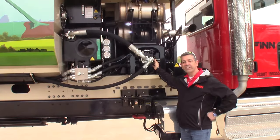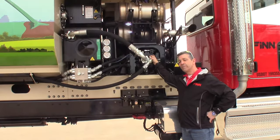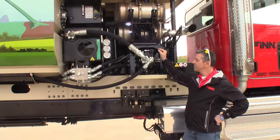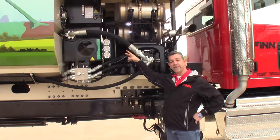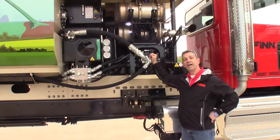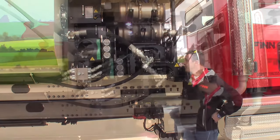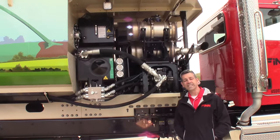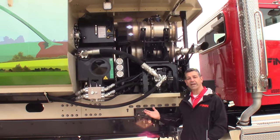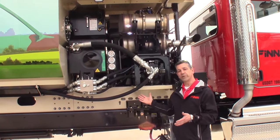You've got a John Deere 173 horsepower engine driving these hydraulic pumps mounted to the engine, which are powering your hydraulic components: agitators, two beefy agitators, hydraulic hose reel, and a hydraulically driven pump. We have eliminated our clutch on this model. Going for a final design necessitated a larger hydraulic tank, so we went from a 50 gallon tank to a 75 gallon tank and a larger footprint of engine.